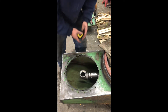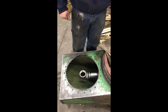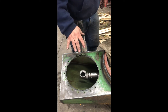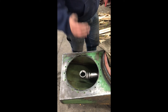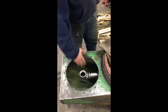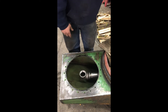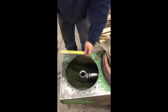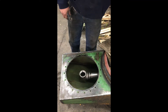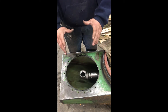Looks pretty good. Maybe just a hair bit forward, but I'm fine with that. The heat exchanger does not have to be perfect in here — more about getting that thing straight up and down and centered left-right. Because when you thread your heat exchanger down, it's 8 inches in diameter while we've got 13½ inches inside of this container. So even if your heat exchanger is not perfect and it's got a little bit of wobble, not a big deal — it'll still thread right down.